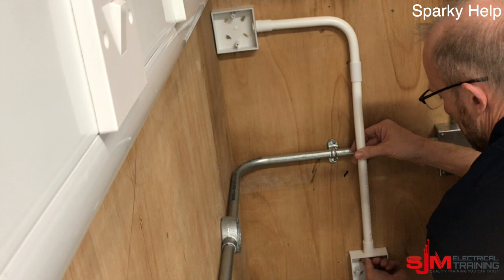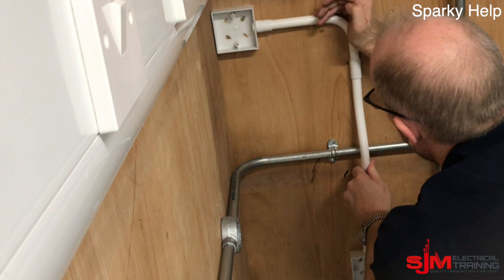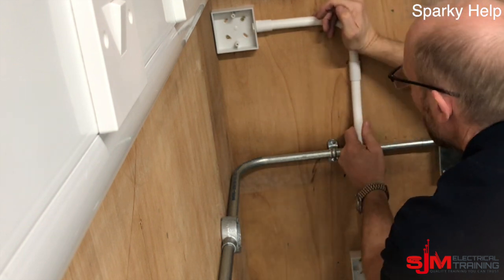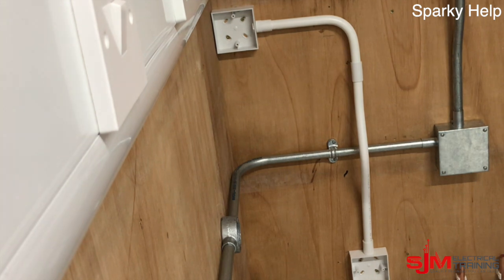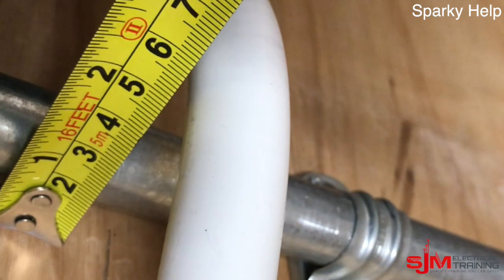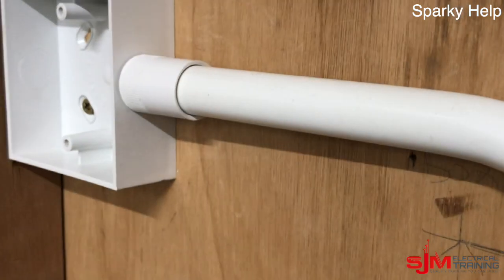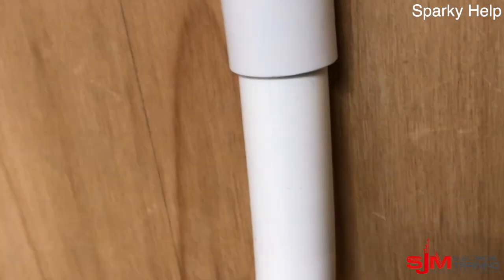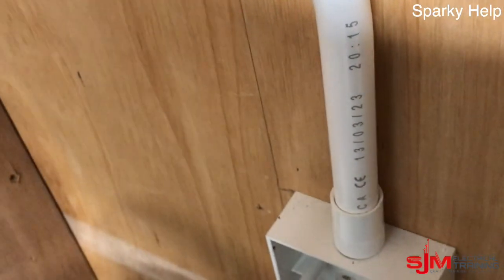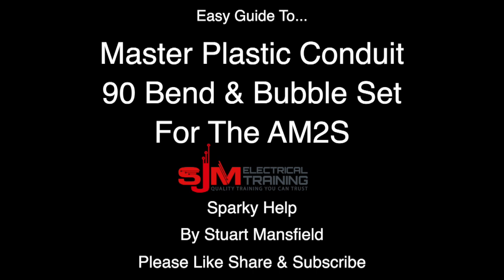Check your connections — hopefully the bends are not kinked, there are no ripples in it, it all fits, it's tight and secure, ready for whatever cables are passing through it. If you really need to you could take it apart and put your spring back in, but make sure it looks half decent and do a reasonable job. This is Sparky Help — please like, share and subscribe, thank you very much.